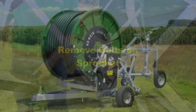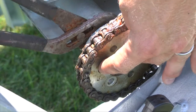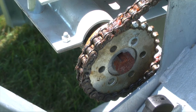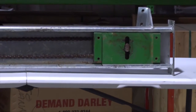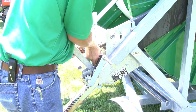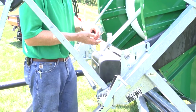Remove the level wind guard. Remove the two bolts on the level wind input sprocket. Now you can manually adjust the level wind mechanism to put the machine back in time. Timing is adjusted by grabbing the gearbox shaft with your channel locks, holding the sprocket still, and making adjustments until you see the drive lug at the 3 o'clock position. Once the drive lug is in the correct position, line the bolt holes back up on your sprocket and replace the two bolts. Once the bolts have been tightened, replace the level wind fork with the four bolts and then replace the guard. Your machine is now in time.